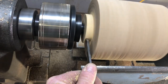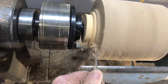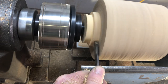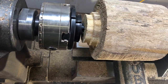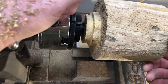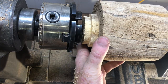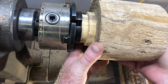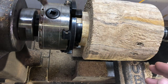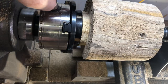The next process was to stabilise the wood using cactus juice. And once I stabilised it in the cactus juice, I put it into the oven to cook. Once I did that, the actual sphere was a lot heavier than before. So obviously the cactus juice making it harder also makes it a bit heavier. So I'm probably glad I did hollow it out, because it would have been a lot heavier if I had left it as a solid piece of wood.